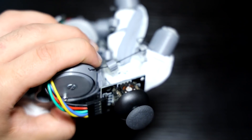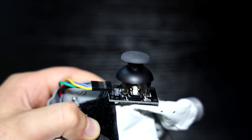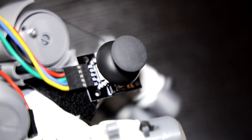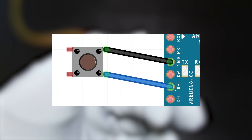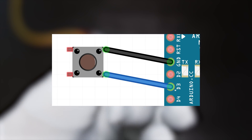If you're using a joystick, you'll also need to wire that up. Most joystick modules have pins for 5 volts, ground, and two analog inputs for the X and Y axis — I plug those into A6 and A7 on the Arduino. Buttons are pretty easy too: connect one side to ground and one side to a digital pin like D3, and let the internal pull-up resistor do its work.